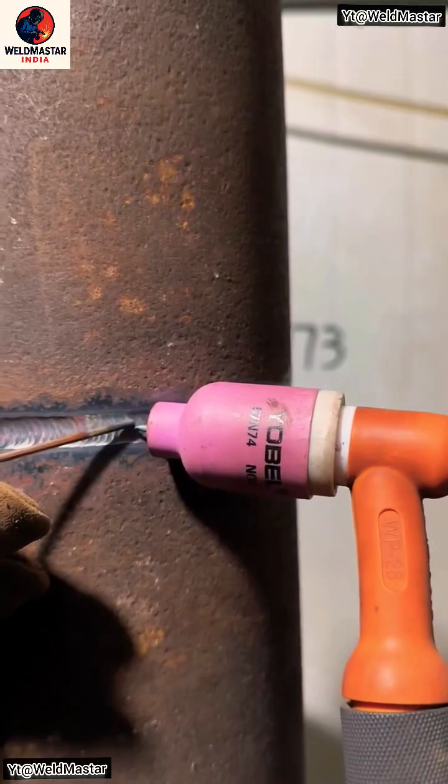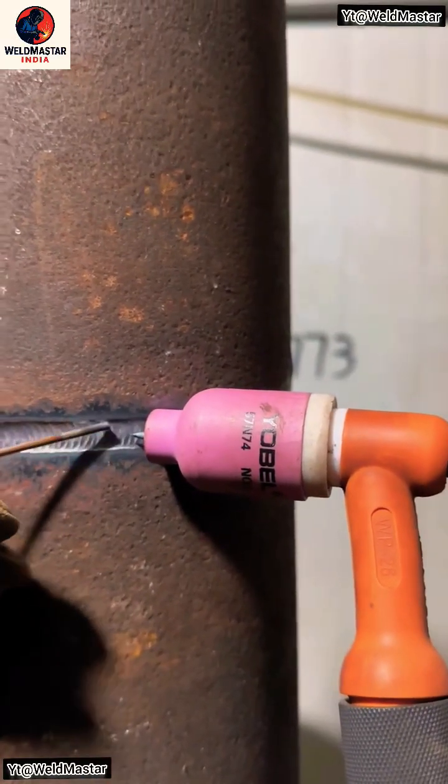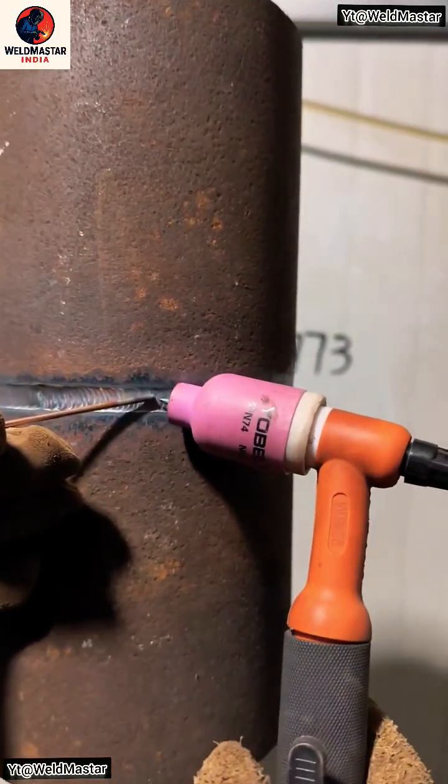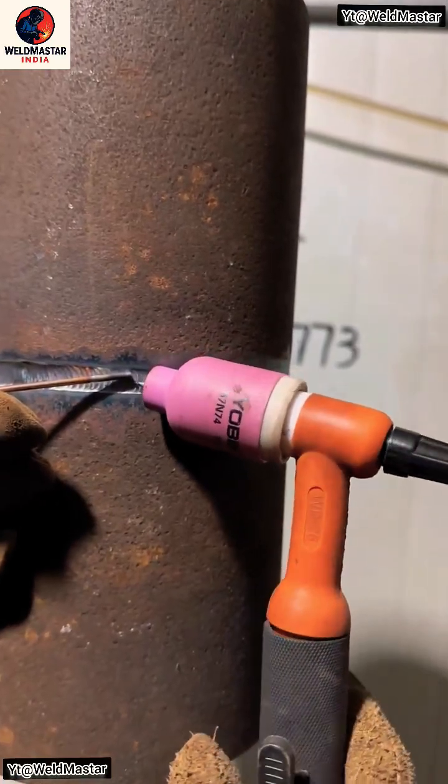When feeding wire, don't overload the top line. Each time you reach the top, pause slightly. And when coming back down to the bottom line, pull your hands slightly backward to let the weld pool flow smoothly. Never press your electrode into the top surface of the molten metal while weaving.